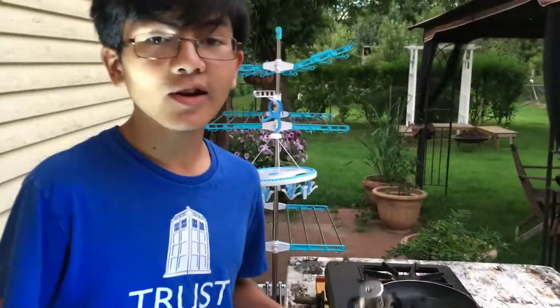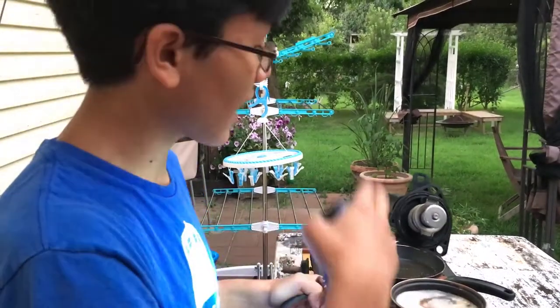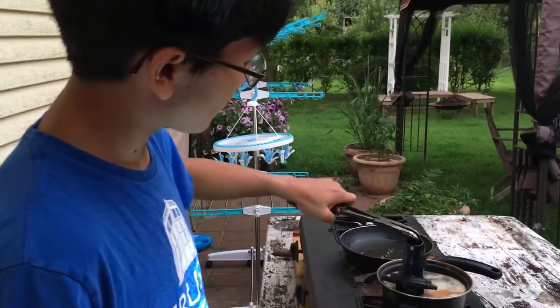You can see the opening forms. When it gets heated up, the metal expands and it causes the plug to sort of come towards us and creates a gap or an opening that lets the water flow through.